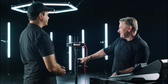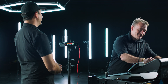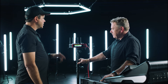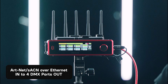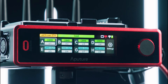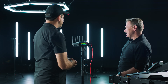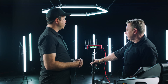I'm going to fix that right now because I don't like to see red boxes on anything. On the side of the Citus 4 here, we have a built-in four-port node. That means we can send out four separate universes out of these DMX ports. Let's go ahead in the console and patch in universes five through eight. What do you see now, Dave? Five through eight — I see E through H, it says DMX out. And at the top? It's green, so it's good. Excellent. So now we've configured the four wireless universes and the four-port node to both send DMX — we're sending eight universes out, four wired and four wireless.